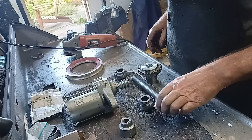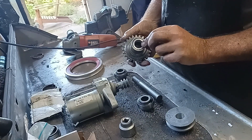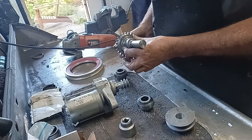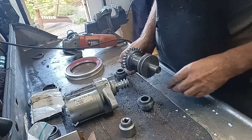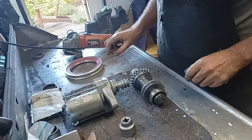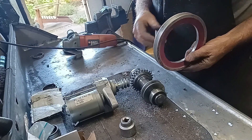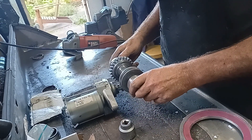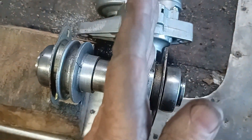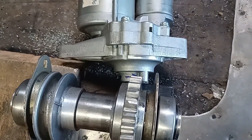Here's the reduction assembly so far. The homemade worm wheel — I've had to sleeve it with some aluminum sleeves driven onto the splines on the inside so that it fits the shaft. Then onto the same shaft goes the lower pulley, with bearings on either side. That's driven by the sprocket. I've cut the center out of this pulley, which attaches to the diff. The worm wheel has to engage at an angle relative to the worm itself to match the lead angle on the worm.